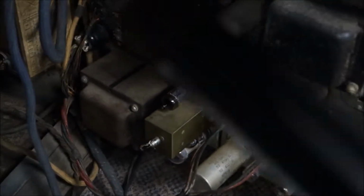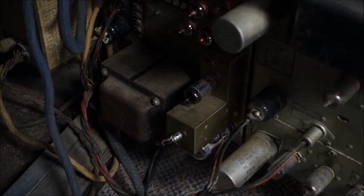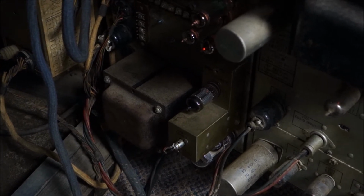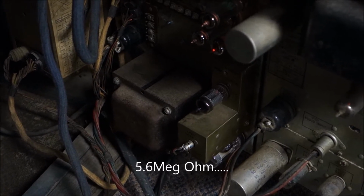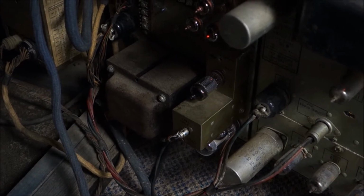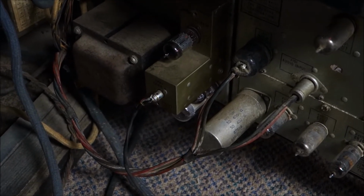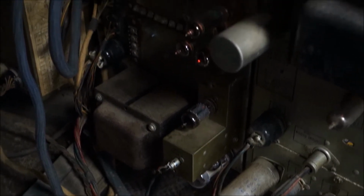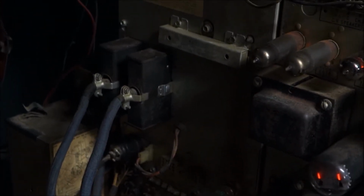Okay, so what we have down here is this pulse amplifier with the 12AX7 and the RCA jack going into that. There was a 56 megaohm resistor that had gone up in value, and it was throwing the bias of that tube all out of whack, and it could not work. And secondarily there was a low voltage on a winding that goes to the trip tube, and we had to bring that voltage up. But these old carbon resistors that everybody thinks you need to have in your old vintage guitar amp, oh man, after those things get cooked for a while, they're bad.